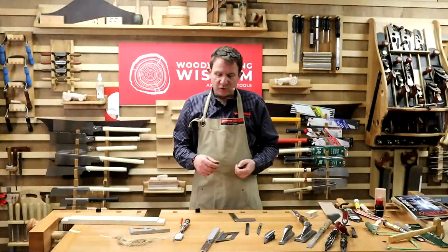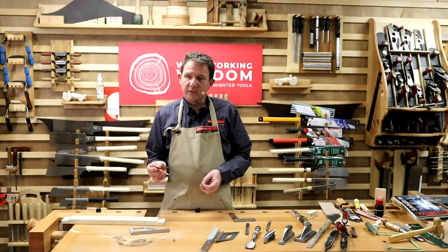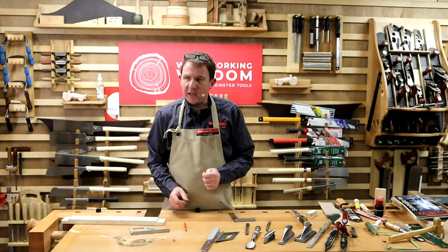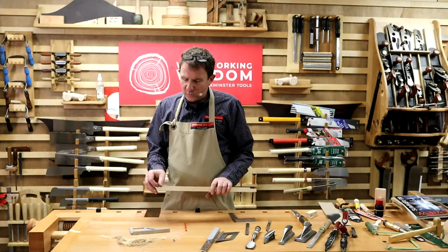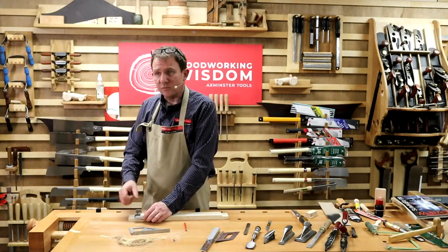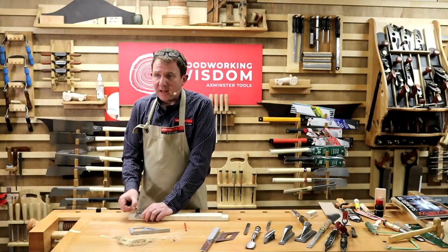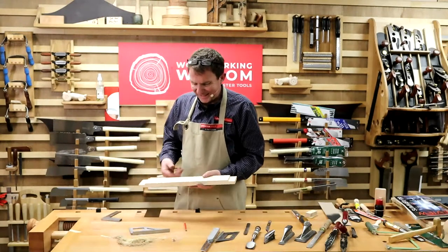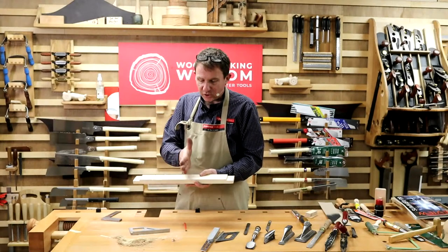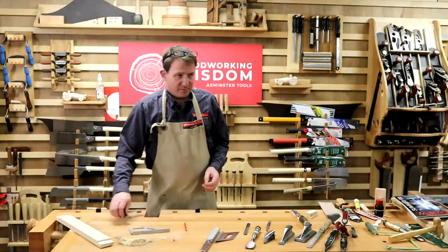All right, okay. I love using the marking knife. Definitely, it depends, Maria, going back to your question there. There are certain things where I will mark out with a pencil first, measure things up, then start marking out with my knife. I might go with a marking gauge to produce a line across it, and then go back in with my marking knife and deepen it. That gives me a nice, easy entry to get that saw into, and a square shoulder to work to. I haven't got to square those up after, so that makes a lot of difference. Okay.